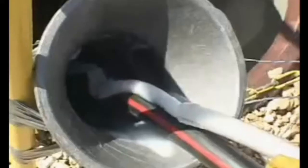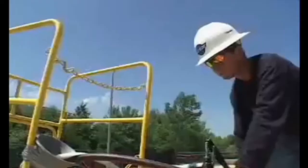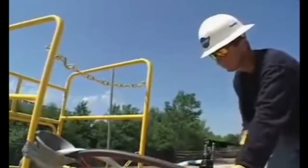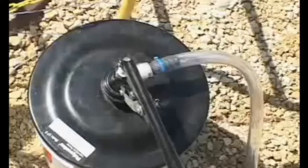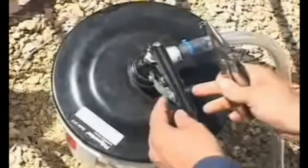Compared to the mess with hand application, the best pumps are designed for water-based materials and pump a broad lubricant viscosity range at acceptable flow rates. Polywater makes several pumps. The LP3 is a hand-operated, self-priming, piston-style transfer pump. Both liquid and gel Polywater lubricants are pumped through the LP3 by adjusting the mechanical advantage ratio setting.